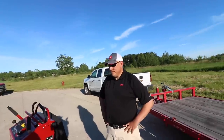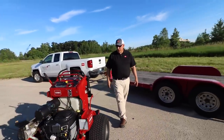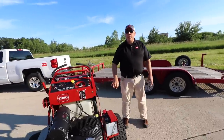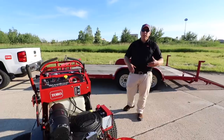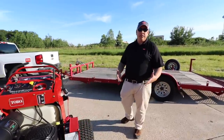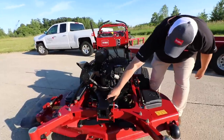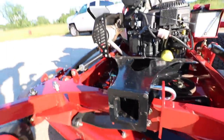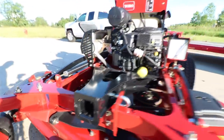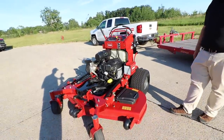That's really cool — I appreciate all the details and stats. Any wrap-up thoughts? The low flow hydraulics can stay mounted on the machine year round. The deck has to come off to operate the implements for safety and weight. The hydraulic ram fits on here and pivots up and down — it's a two-inch receiver, just like what you have on a truck, and that's what holds the quick connect system for all of the attachments. All the hydraulics are quick connect.